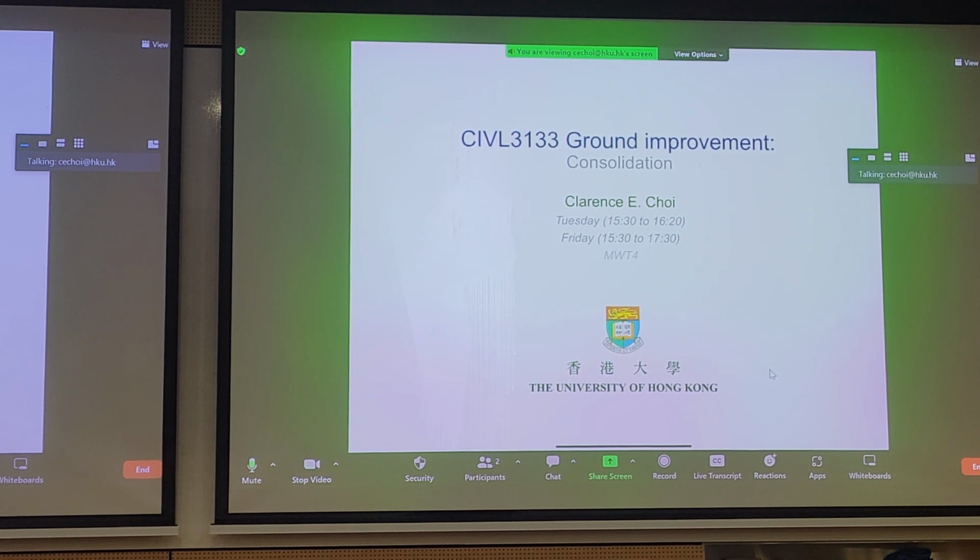It can be something very simple. How do you calculate the degree of consolidation? And it shouldn't be a complex answer, right? If you know the change in pore pressure relative to the initial surcharge, the excess pore pressure, it's just a percentage, right?